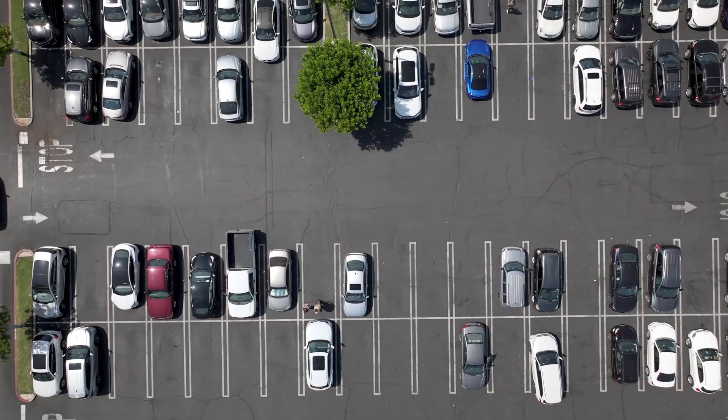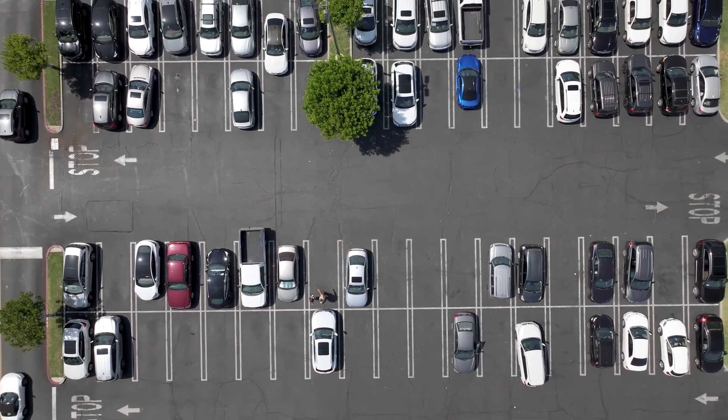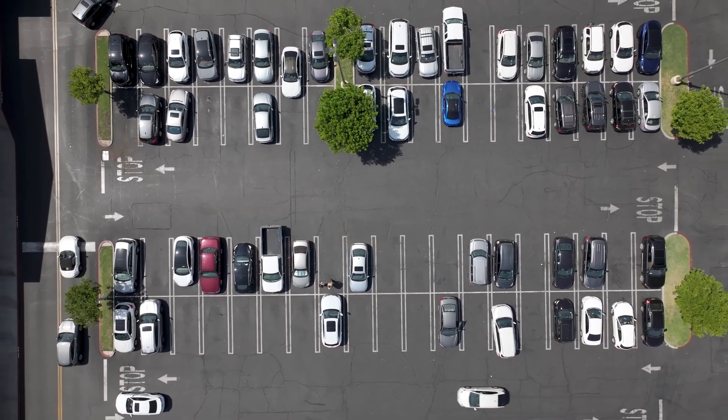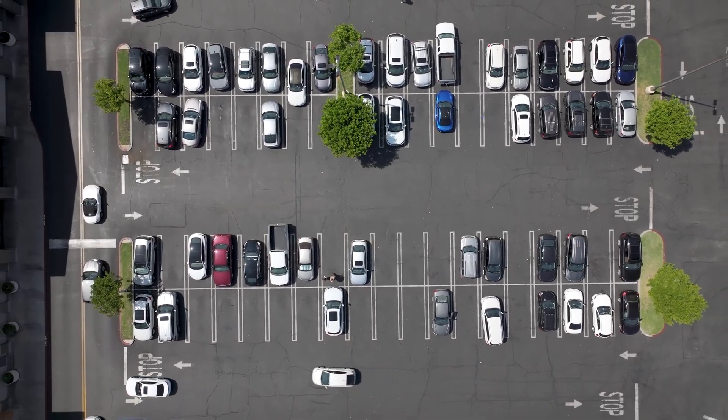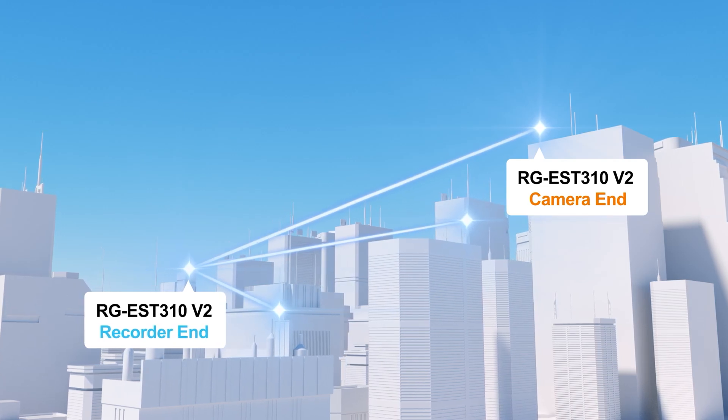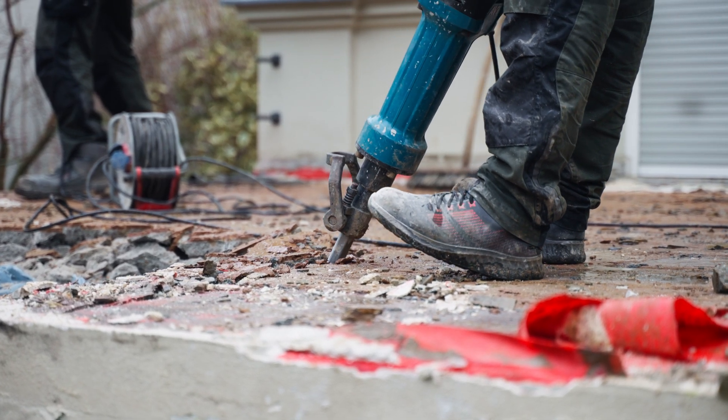For example, you may have a car park surveillance system. Often cameras need to be installed far from the main building where the NVR or control centre is located. With the RG EST310 version 2, you can connect your IP cameras to the network using the wireless bridge without the need for direct cabling. This is very useful in scenarios where your only option is to install cables underground, which for most installers is not an option.